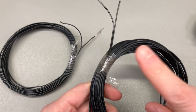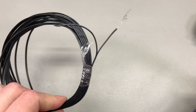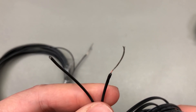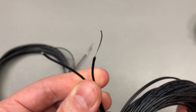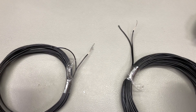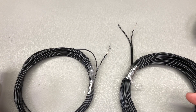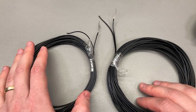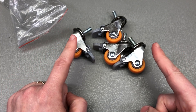The 24 AWG has a bit more copper than the 26 AWG, which doesn't inspire a lot of confidence. The strands on the 24 AWG kind of stayed intact and glowed red when subjected to the flame. If you know of a source for similar cable but of higher quality without breaking the bank, let me know in the comments below. I'd mainly be looking for more copper, better copper purity, and maybe some more flexible insulation.